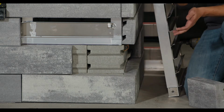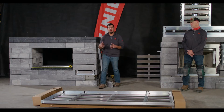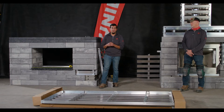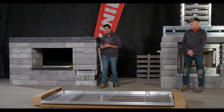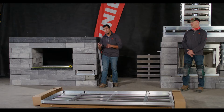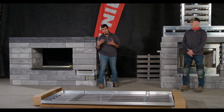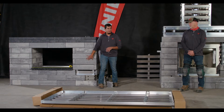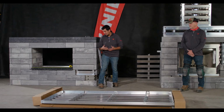One of the things, again, in keeping true to the cabinet mantra, these are very lightweight. This whole unit, as you see it, is about 1,600 pounds, give or take, right? Still very lightweight for the size of the unit. But that allows us to figure out on the bottom there that we're still going to recommend, and Bruce, correct me if I'm wrong, a concrete base on that bottom piece, right? That's best practice. I think we're comfortable sticking to that. I think there's enough time savings on the back end when you're building this that a poured in place footing is probably still the recommended spec there.